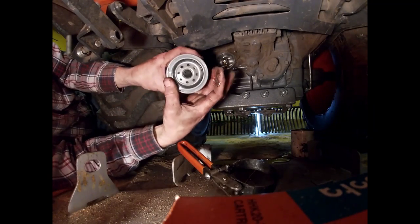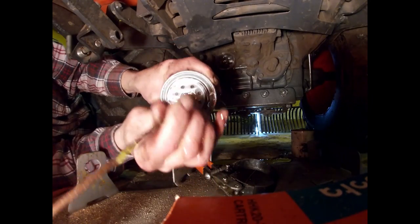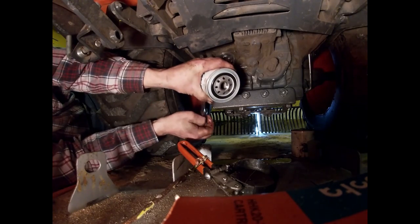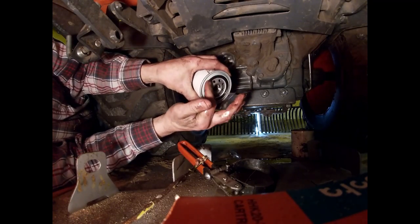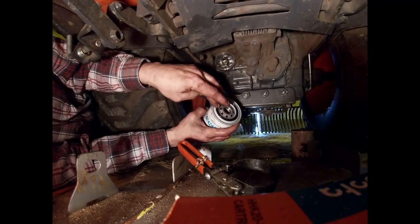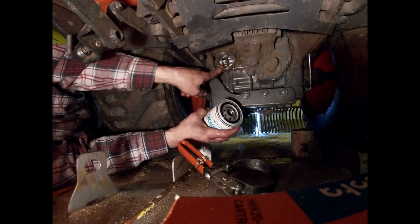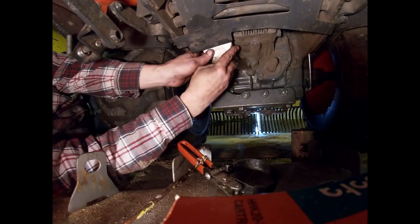It's got a new filter. The O-ring is cupped a little bit. When you get a new one it will be flat, and it will leak as soon as you put hydraulic pressure on it. Clean that off real nice with your dirty fingers and put it back on.